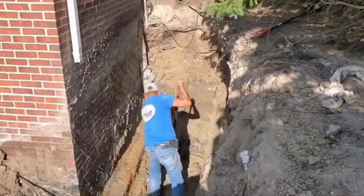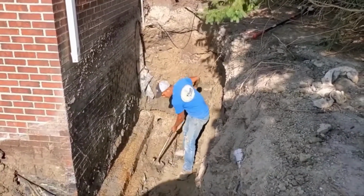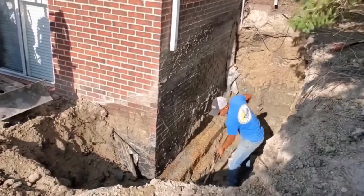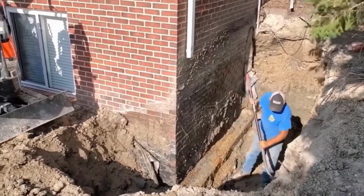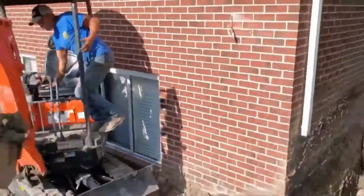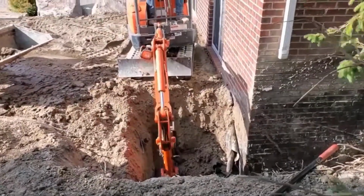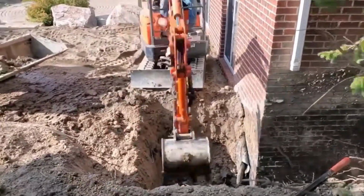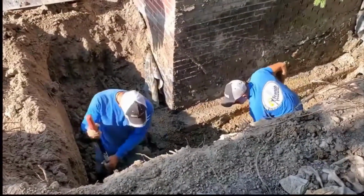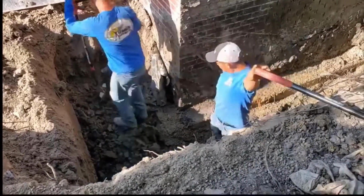I always get asked in the comments section, how much does something like that cost? I'm not even going to hesitate to tell you, something like this, you're looking at about $40,000. Labor, haul out, and we like the Keystone block. Fendt distributes it here in Michigan, but the Keystone block is 86 pounds a block, and you use fiberglass pins to hold it together. This block doesn't go anywhere. You fill the center of it with drainage stone. You fill behind the wall with drainage stone.